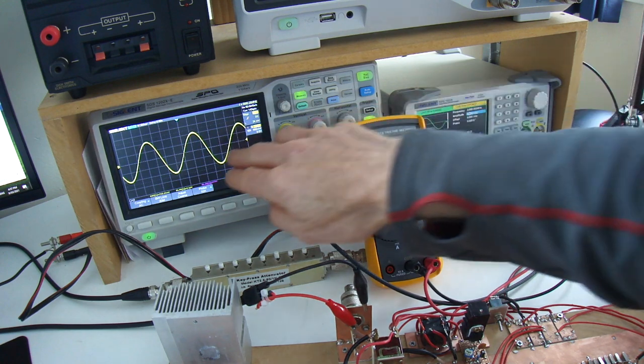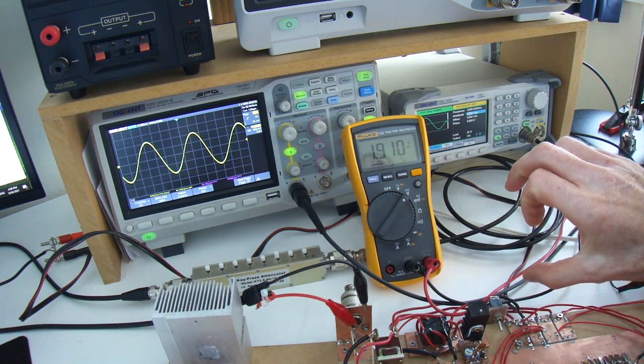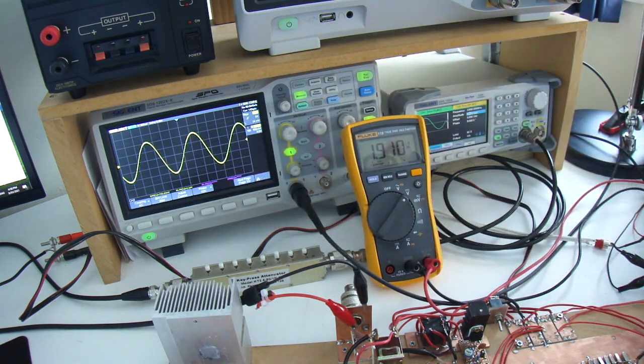to the mid-range position so that with no AGC applied, in other words, with the radio going flat out from a gain point of view, with 2 volts peak to peak, I don't overdrive the audio amp. I've got a nice level there.